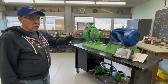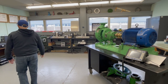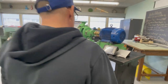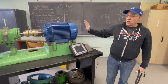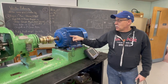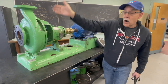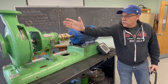When you're going to take a reading, a lot of times you're noting that the equipment is making a lot of noise — something could go wrong at any time. We label our machine by the transmission of power: starting at the outboard side of the motor as position one, inboard side of the motor as position two, inboard side of the pump as position three, outboard side of the pump as position four, and so on for any gearbox.